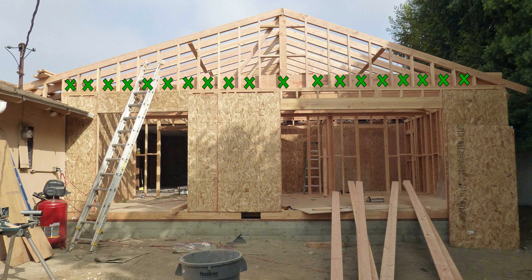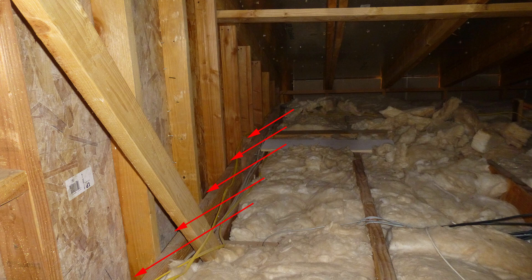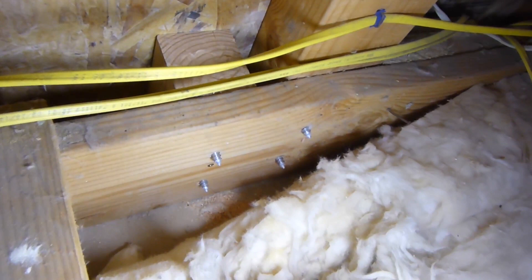So the solution is to put bolts where the green crosses are. However, as you can tell from this picture, those locations are hollow — there's no solid material behind the plywood. So my solution was to squeeze in pieces of 4x4s to fill up the hollow space, so the ledger bolts will make their way into all solid materials. The bolts are long enough to thread through all these layers, firmly attaching the ledger board to the house structure.